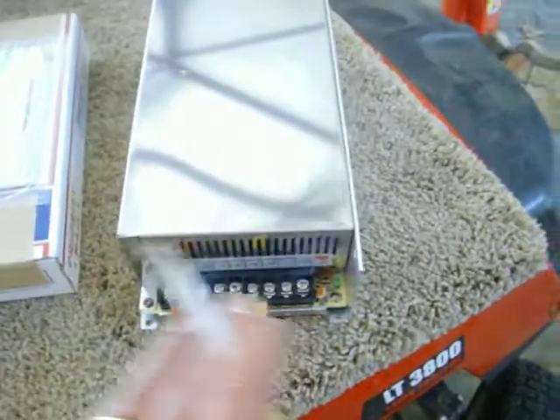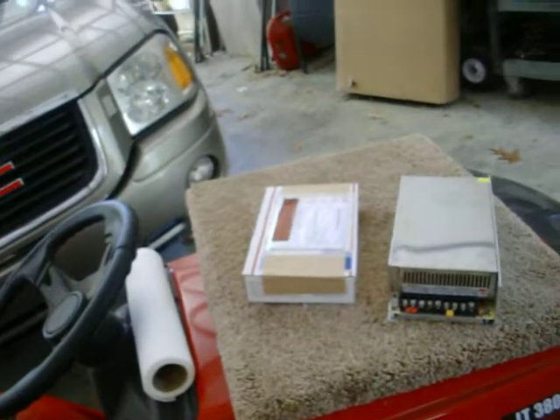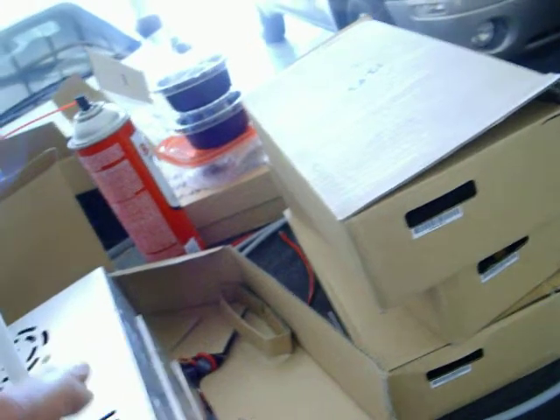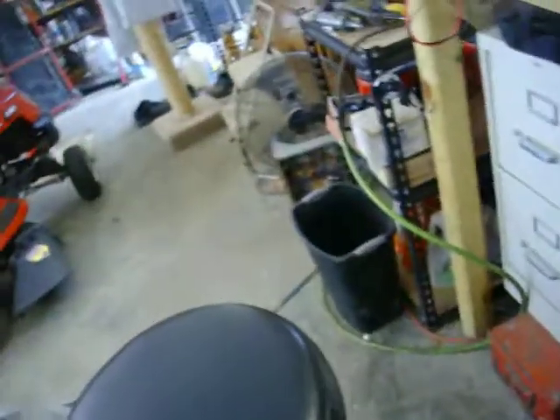I can bring this 50-amp one up with a simple resistor — I put it on the bottom side — and I can make this go up to 19 volts, but the caps are only 16 volts in it. Some have 25-volt caps in them, but with three of them together they're running at 21 volts. Might tame them, but anyway, this is what I don't like.